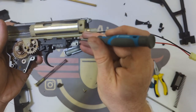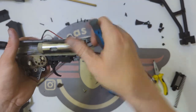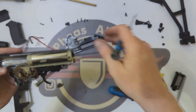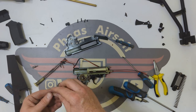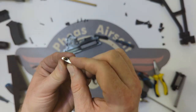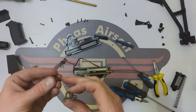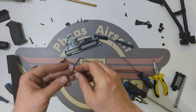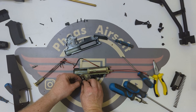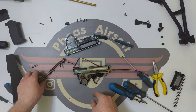What I'm looking for is making sure this spring is right down on the post here — that's important. I'm making sure the cylinder is flushing its gap and squaring that off so the vent is clearly in the opening. This is springing backwards and forwards and I'm happy with that. The grease is minging. Next thing: the anti-reversal latch needs to go in. It's a tiny little latch and spring. That little arm pushes it into the way of the gear so when you let go of the trigger, this stops it unwinding.